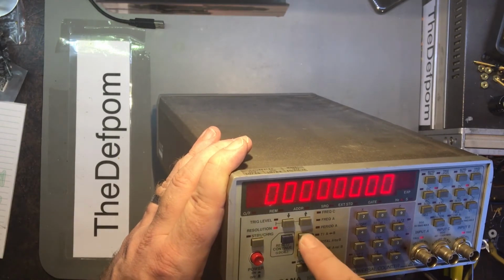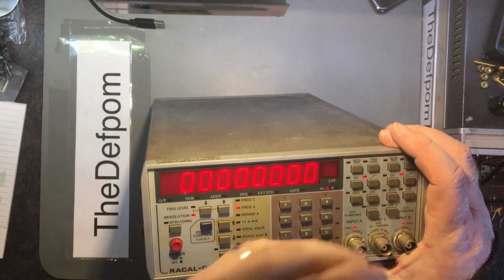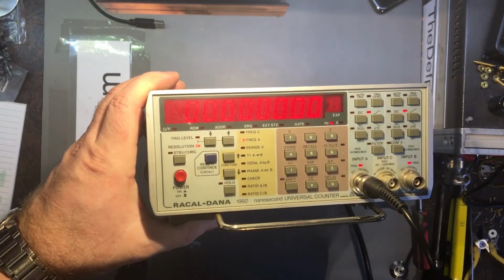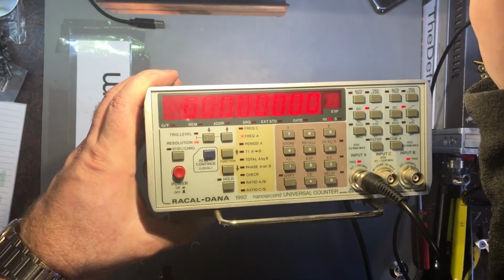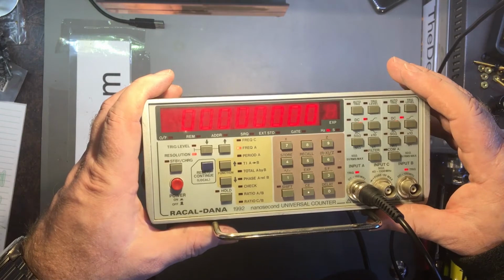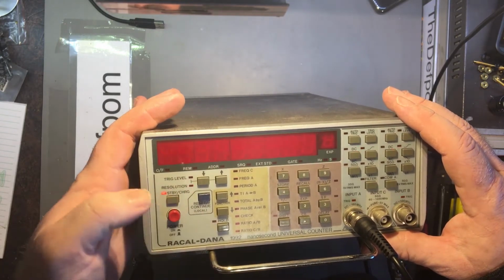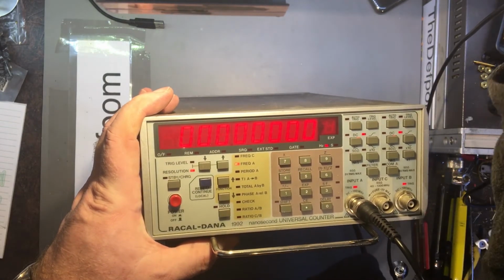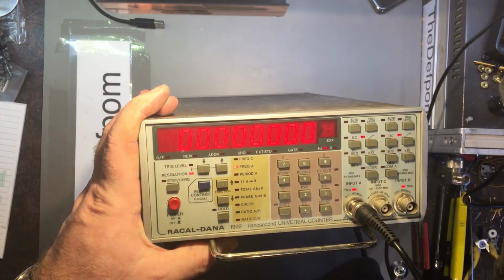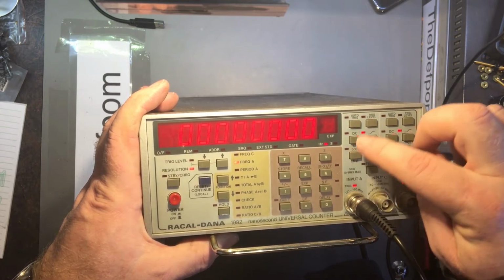Okay. Right, I need to chuck a frequency into this thing and try this out. Let's fire up the trusty Marconi and grab a BNC input. Increase the output level, turn modulation off, just for the sake of accuracy. Level 0.1 volts should be good enough, I'd have thought anyway. What's this all set to? There's no trigger showing, 0.2 volts. Is there an issue? 0.5 volts. It's not triggering.